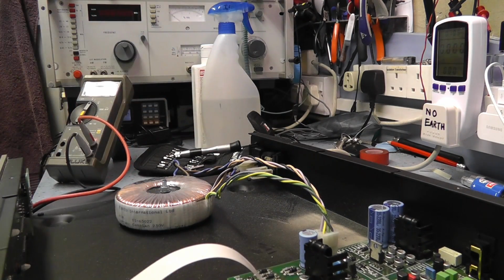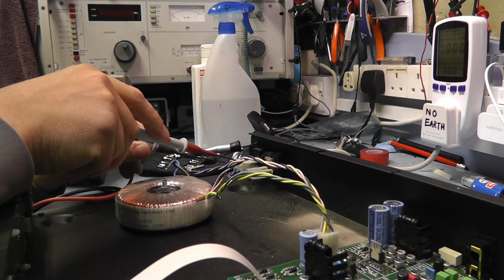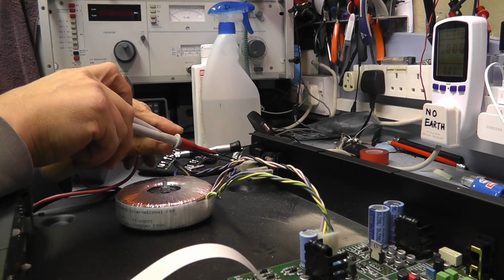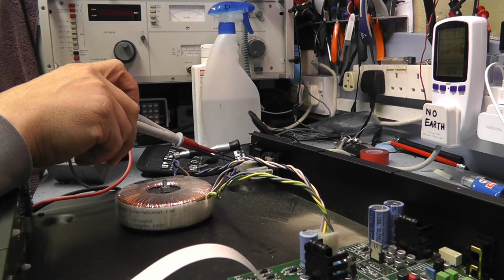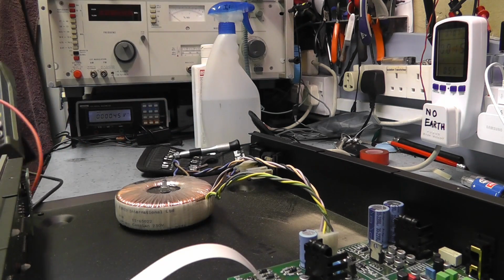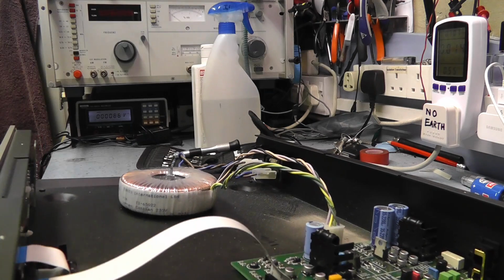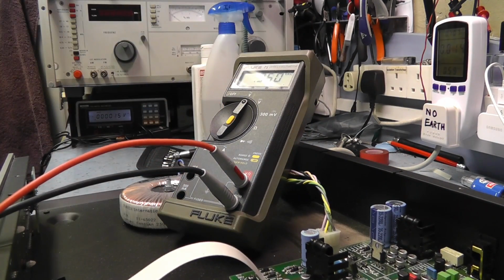I suppose I've got it. Should we just check we switched it on? I'm sure it is switched on. Let me just check this. Okay, so we're going across the main switch. Got nothing there. Okay, we've got AC volts now, so it wasn't turned on at the back. Okay, so let's go back and check the secondary again and see if we've got anything now.